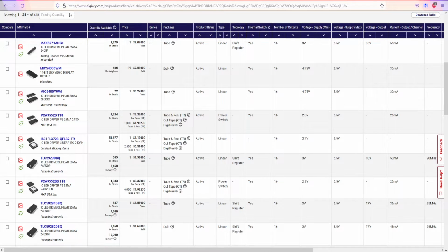That's why I have to go for SMD, because if it's gonna be through-hole components, I have to make a sandwich of different PCBs and so on, so it's just a waste of time. So I'm gonna go with SMD, but keep in mind these SMDs will not require a hot air station to solder it, just good tactics and a soldering iron. That's my deal right now.